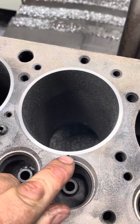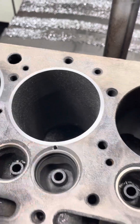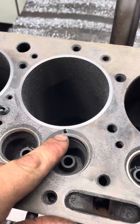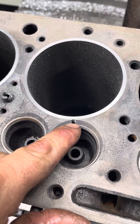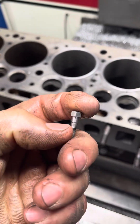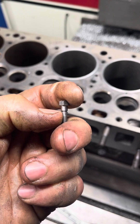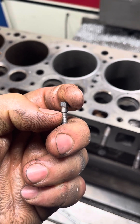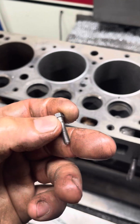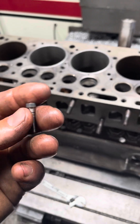The pin just barely intersects the sleeve and it just barely intersects the top of the valve seat. So we put a little dab of red Loctite in there, then we tighten this pin in there. It's got that little — I'm not exactly sure of the terminology — but that little shear joint right there that goes in there to fix the crack.